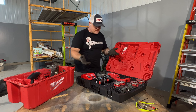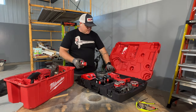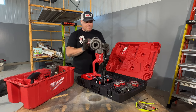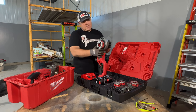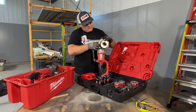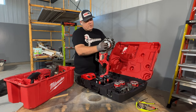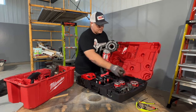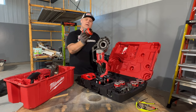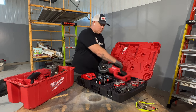Charger case, of course. Now these die heads — here's the inch and a quarter — it just snaps in and out of here. You can put it on either side if you'd like. And then there's a lock: you turn this black wheel next to the die to lock it in place. Once locked, I can't pull it out. Unlock it and it pops right out. It's not a friction fit like the 12R style die heads that fit the larger machine.